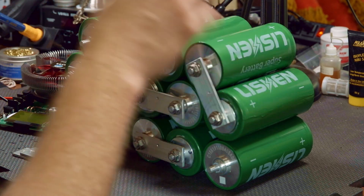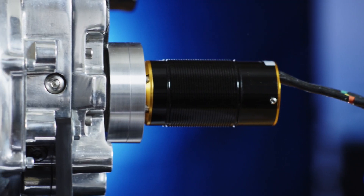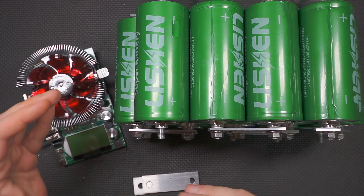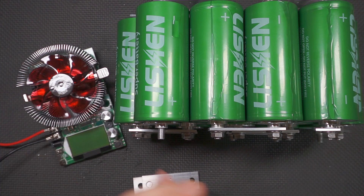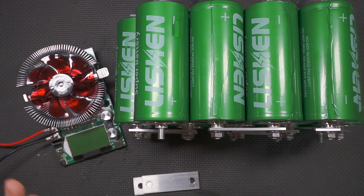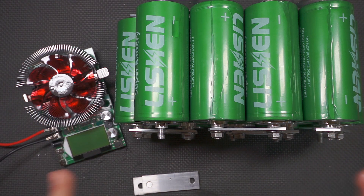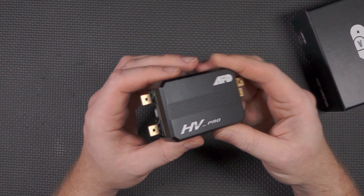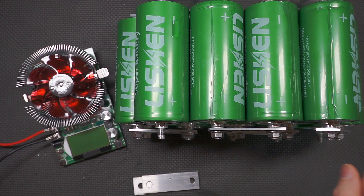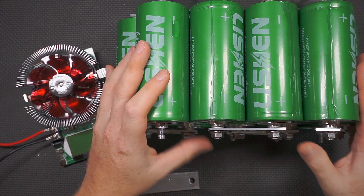The advantages vastly outweigh the disadvantages. I'm not going to be satisfied until that TP Power motor is fully saturated and maxed out. It's rated at 52 volts, but looking at previous data logs we were around 48 volts, so there's still room to play. The guys at APD who made the ESC have confirmed there's still power left in the motor. I want to extract all of it — we're running nines if it kills me.